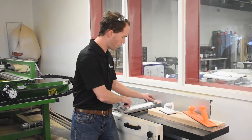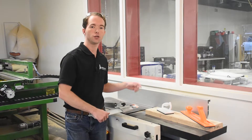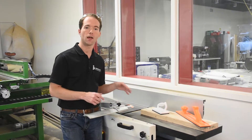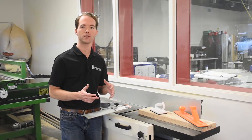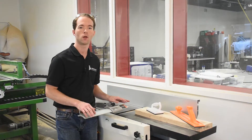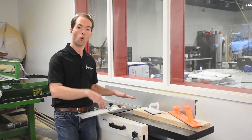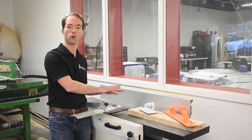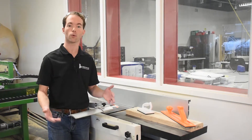This tool has a set of rotating knives that chip away at the wood. This cutter head has straight knives. They're cheaper than spiral cutter heads, and they do an acceptable job for what we're doing in here. We can use the top side or the bottom side of the cutter head. When we're using the top side, we're in joiner mode. When we're using the bottom side, we're in planer mode.